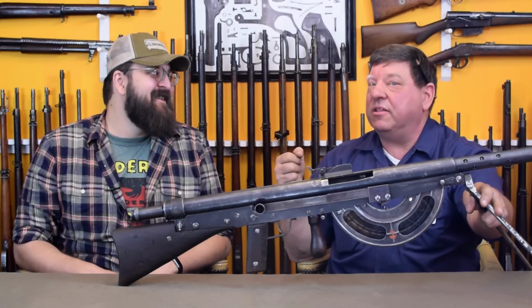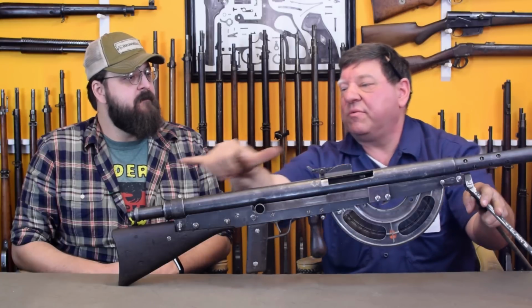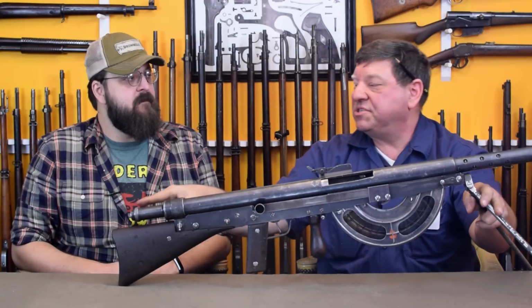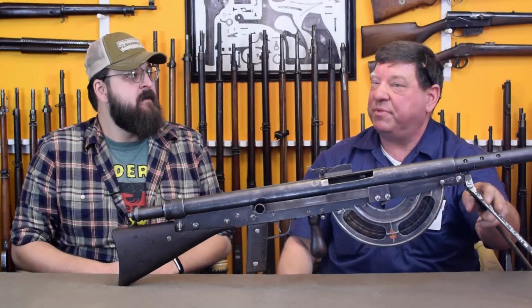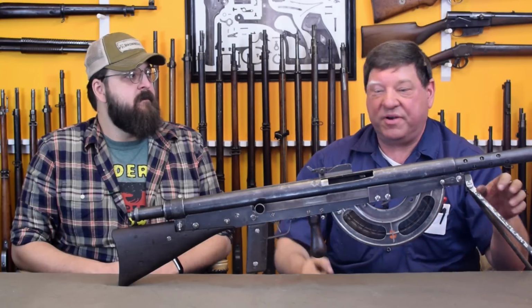The recoil could have been a lot worse. If the spring had been strong enough, it would decelerate the bolt. But I'm talking about this thing had come to the rear and it would sit there, almost like on a Lewis. Well, on a Lewis, I can explain it. You got to wait till the gas system depressurizes before the spring can start running it back forward again.